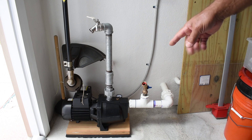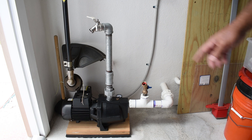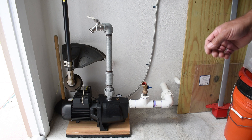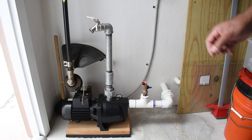The pump you see here, which I've had for two years and works great, is a dual voltage, one horsepower motor. I can power it using 120 or 240 volts, but because the motor is one horsepower or less, I generally will use 120 volts. This pump only uses 1000 watts when the sprinkler system is running. The other advantage to wiring it for 120 volts is in the event of a power failure, I can use my portable power station to easily operate the sprinkler system.